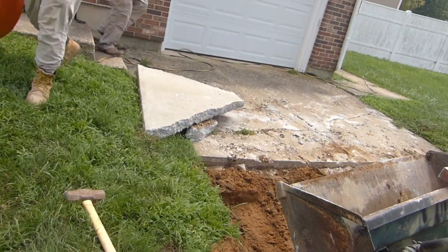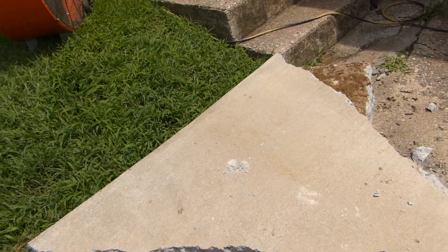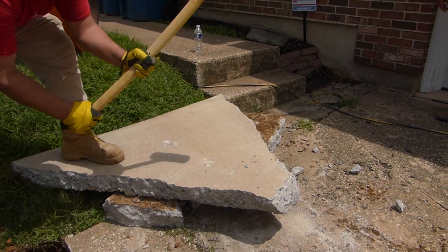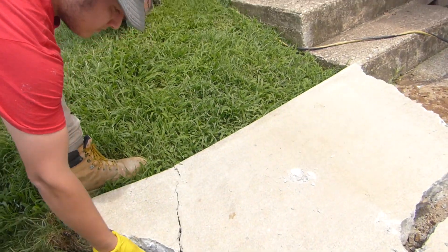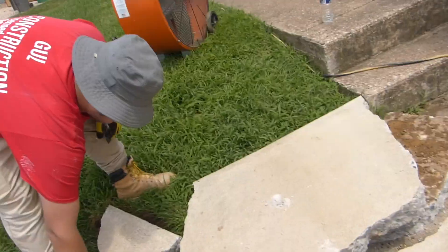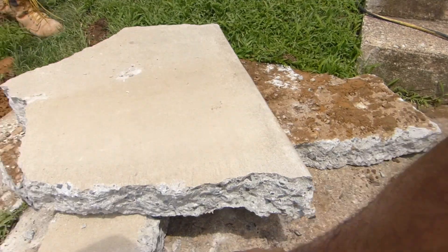I'm showing this young guy how, on an overhang cantilever, you can fracture concrete using the advantage of its overhang. Do not pound it while it has full contact surface on the ground below — that's not where to hit it. You see him hit it and it just shatters away. He's choking up on the hammer pretty tight, but I'm teaching him. There's the crack I speak of — it fractured. So we find another cantilever and I explain to him how to fracture it. I create another overhang and I'm going to tell him where to hit it again to show him how to fracture this concrete so easily.